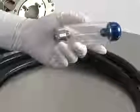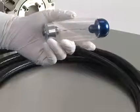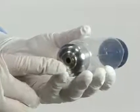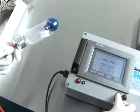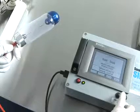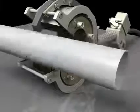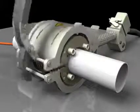The SIB3 inflatable support bladder is comprised of a fluoropolymer sleeve held in place by 2 aluminum end caps and connected to the control unit by a push-to-connect pneumatic end connection. This demonstration using the manual controls shows it in action. When making a weld, the bladder is inserted to the weld point and it automatically inflates and deflates at programmed intervals during the weld cycle. It supports and maintains the ID and provides a smooth inner bore fluid path.